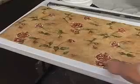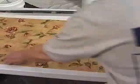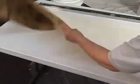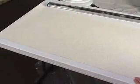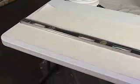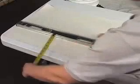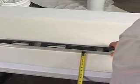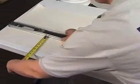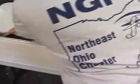Go to your work table and find the edge that will butt into the last sheet hung. Put that edge towards you and flip the sheet face down on the table. Measure from that edge into the sheet the same distance you just measured on the wall, including the 1/8 inch added. Place your level onto the sheet at the distance. You may have to remeasure from the level to the edge several times and in several places to make sure you are even. Hold the level with your off hand.